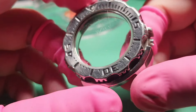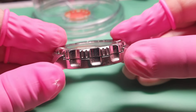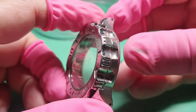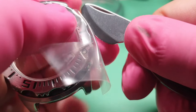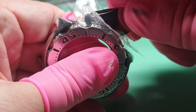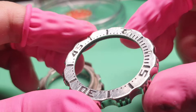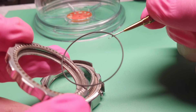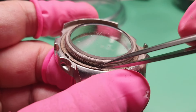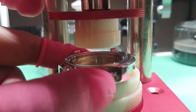I think I will have to remove the crystal and later on I will replace it. I will have to find a sweet spot to remove the bezel first, and then I will remove the crystal. The painting of the marker is off, so I think I will repaint it. The bezel gasket I will also replace. This is the click spring. I am using a crystal press tool to remove the crystal.